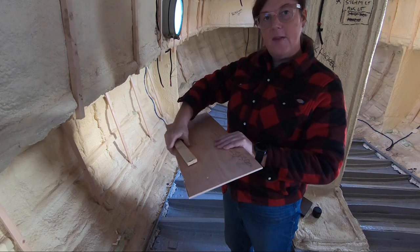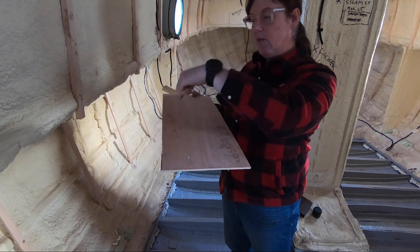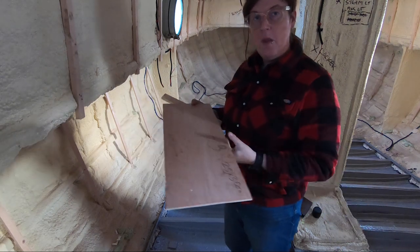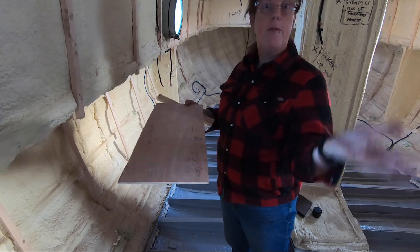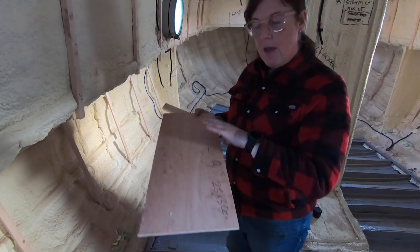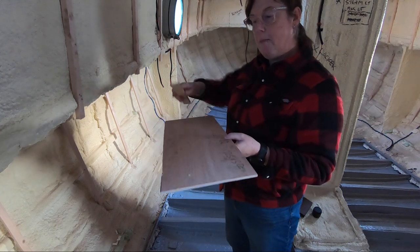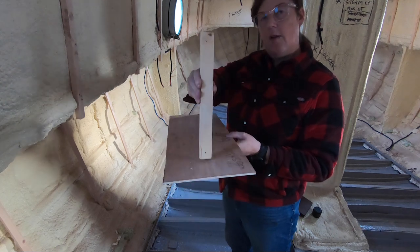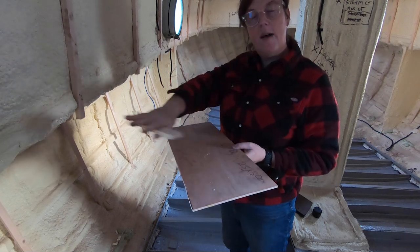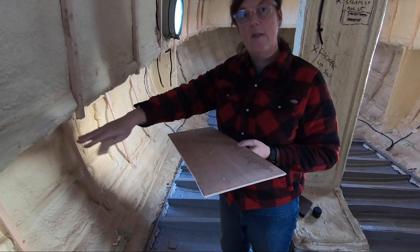So imagine this is a piece of 18mm ply, and this is going to form my floor. If I put it in the same way as before, I would screw through the ply and into those angle profiles. But as I mentioned, that's hard to remove later on. So there's a couple of approaches I'm going to take. Firstly, the ply subfloor is going to be 18mm ply. The ply subfloor I'm going to put down first is only enough to support the walls. So if you imagine this is a section of the ply, and then a stud wall is along here, I'm just going to put a narrow section so that I have enough to support the wall. That'll mean I've got a huge gap at each side, but then I'm going to put some more ply subfloor in those areas separately.